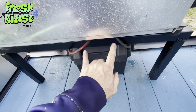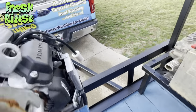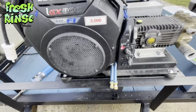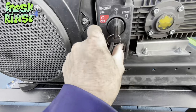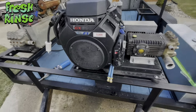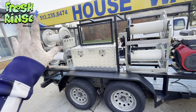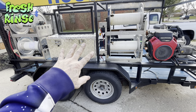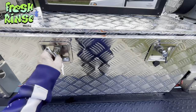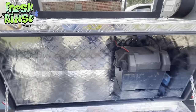I have the cables hooked to the battery using the proper-sized lugs, and we should have power. Yes! We have 130 hours on the 10-gallon-a-minute machine. And there you have it — we now have power to both the 8-machine and the 10-machine. If we had water and fuel, we'd be ready to wash. In the next episode, we'll be connecting all four hose reels to the main battery. All we're waiting on is the other two 100-amp fuse panels/breakers to show up, and we'll be good to go.